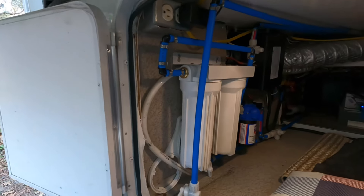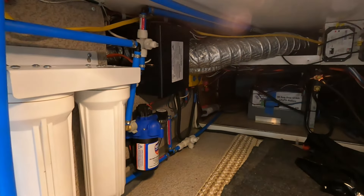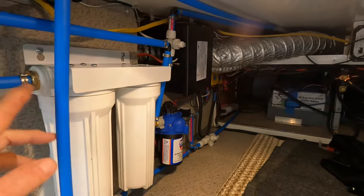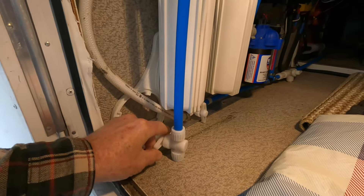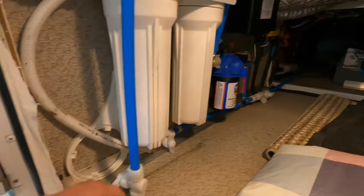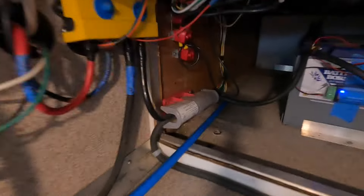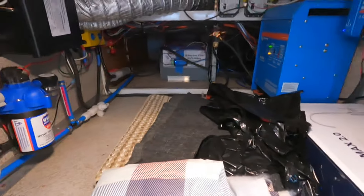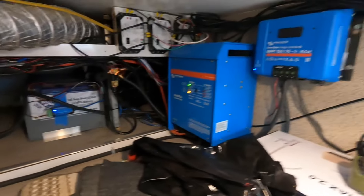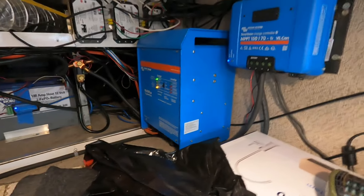It's kind of hard to film. I got this one portion done — all the tubing is connected. I was able to crawl up in there and get it together way up in there. Twenty minutes later: filters mounted. This is the out, and I put a valve here — turn this off because when we're hooked to city water I don't think the one-way valve way up there is working. So I put a shutoff here; when we use the pump I just turn this back on. Now to get the water pump over here and everything run out the drain.